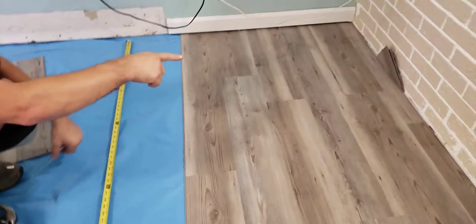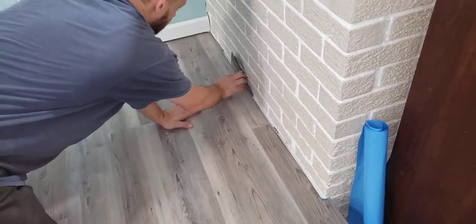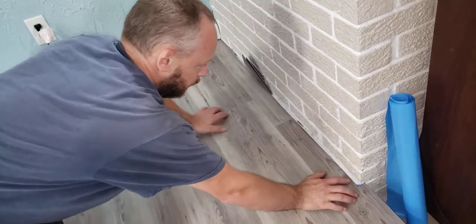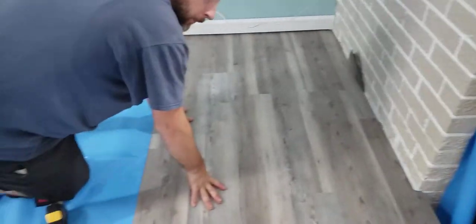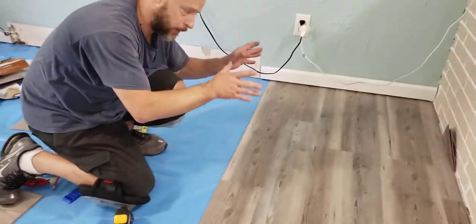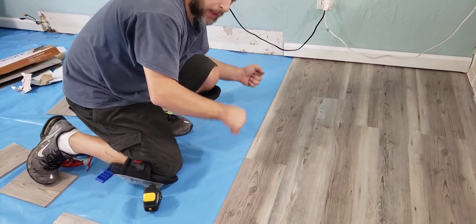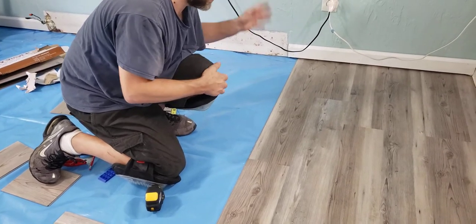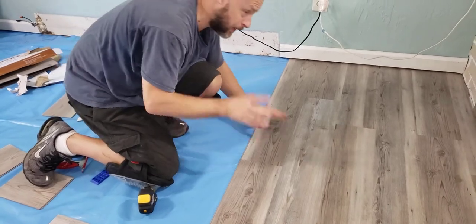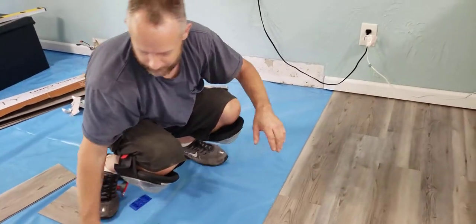I put spacers in the corner because to keep this straight going against this brick, you have to give the illusion that it's square even though it's not. I'll put the channel piece here and caulk it — I'm not going to drill into the brick. You've got to put the vapor barrier down with a stopper as your shim. That comes out when you're about three-quarters through the floor. Just leave yourself hitting the wall — it will slide enough under. I'm going to go about a quarter inch under; that's a half inch drywall. It's not going to float — expansion and contraction isn't really an issue with this flexible material.